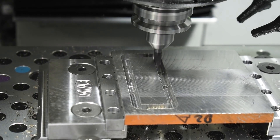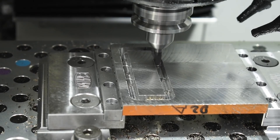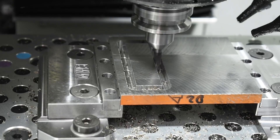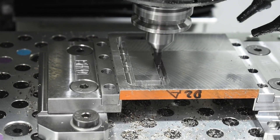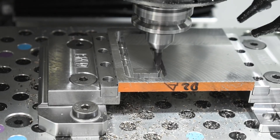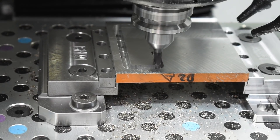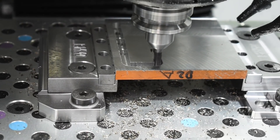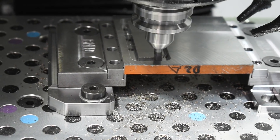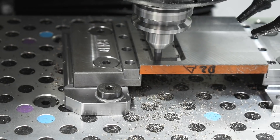In hindsight I probably should have increased the plunge rate because it was plunging into nothing — into a pre-drilled hole — so I could have increased that quite a bit to speed up the tool path. What's cool about this is with the pre-drilled holes your tool is side cutting pretty much 100% of the time and you don't have that sudden load increase of a plunge on the other end of a tab. Even a triangular tab does increase the load as it's going down the other side. Another benefit was that the pre-drilled holes also allowed for more chip clearance and chips would just flow down and out.